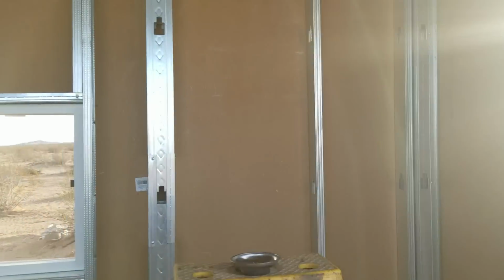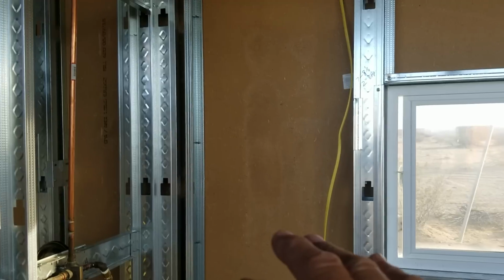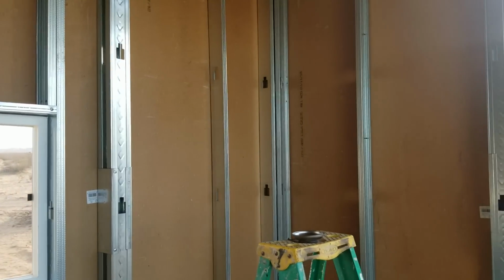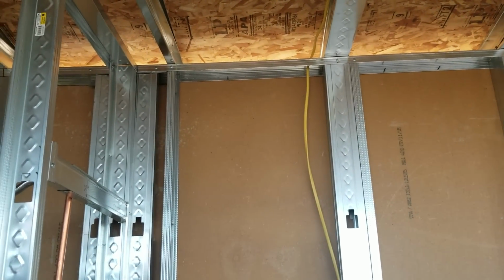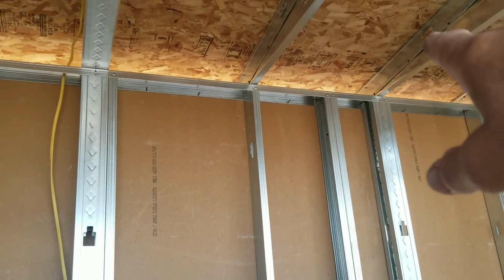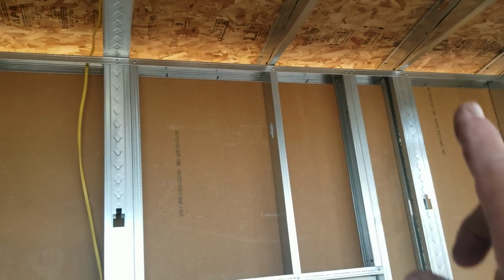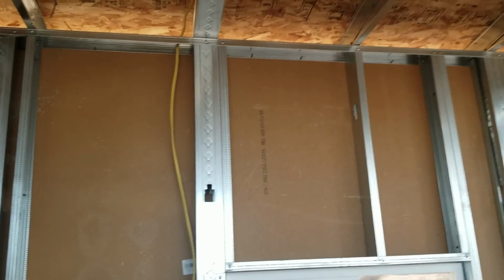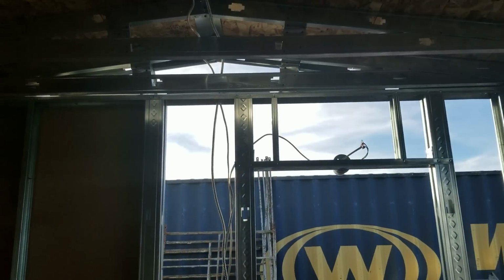And as you can see, I now have the wind side here protected, except I left the window open, so there's still a little breeze coming through. And I've got this closed in, but you still see light up in there. Well, that'll all stop when I put those eave caps outside. You won't see that light there anymore. And then in that unit and this unit over here, from the outside, I drill some holes up in there, and then I put a screen cover over that. That allows me to take cold air up the walls and into the attic. And then there'll be an eave vent on that end right there to push the hot air out.